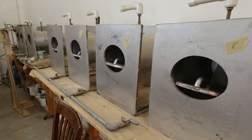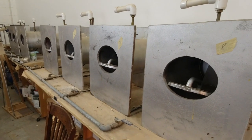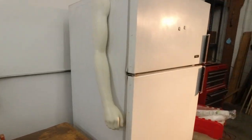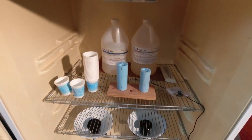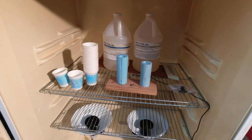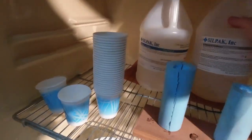The thing you really need to remember is that temperature matters. This is not complicated — if you're comfortable, the resin is comfortable. I work in a big old warehouse, and it's way too big for me to heat the whole thing, so I don't bother. I just heat the local environment, and that means heating the materials we work with. Here's the hotbox — it's just a repurposed refrigerator. If you want to learn more about how I made it, you can watch the video up above or in the link below.